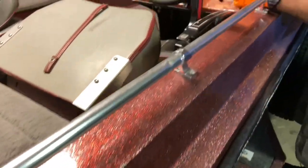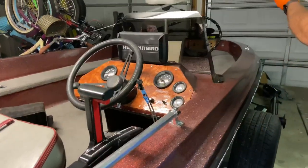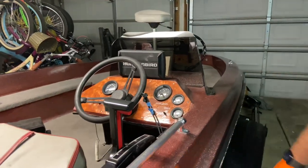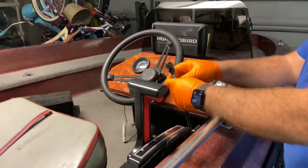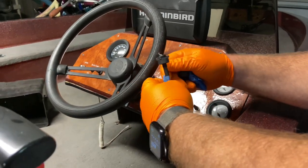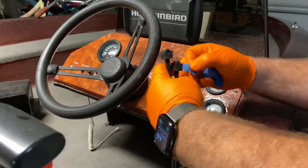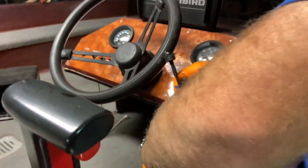So if you can look up here, here's the finished result — I'll take the tape off and get that fish stick out of here. As you can see, I had both cable ends taped together and then taped them to that fiberglass fish stick to pull them through the side of the boat, and I've got them pulled through the mounting hole.